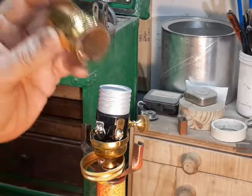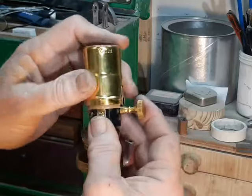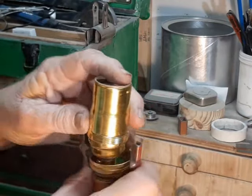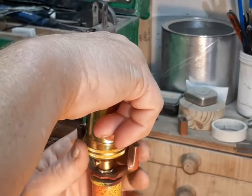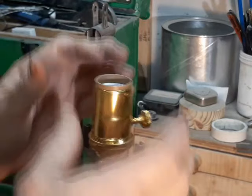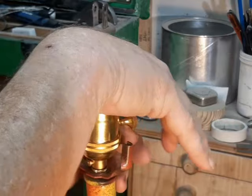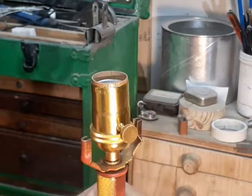Now our socket shell — put the paper insulator in place, it comes down, this goes all the way up in there. There's a little bump right here that fits in that notch in the back. Get that seated down and very carefully screw this on, get it nice and tight, fully seated. And this lamp job is finished.